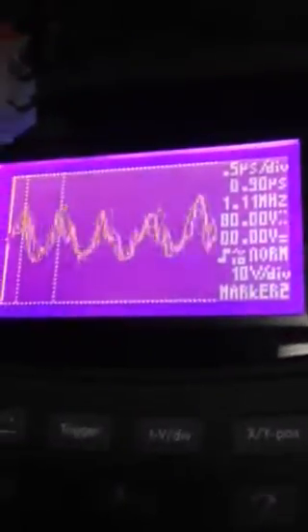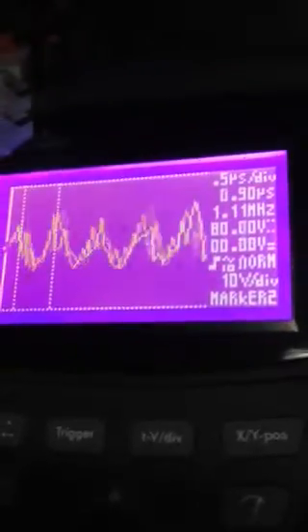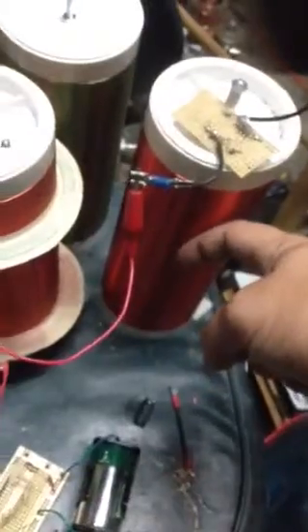There's an interesting coupling effect going on. Let's show you the waveform. Right now this coupling is in effect — it's running at about 1.1 MHz. But if I take my finger and just touch it to this other coil, now look at the waveform.